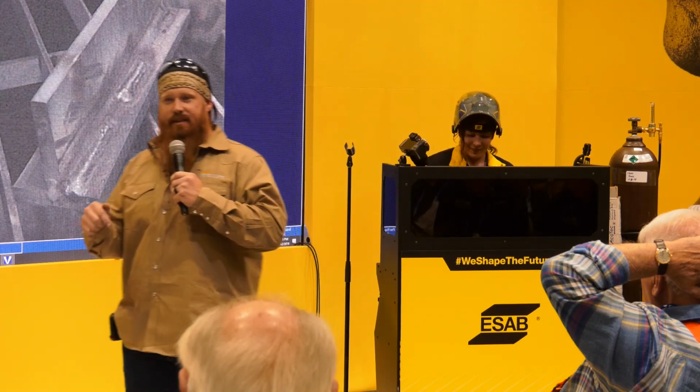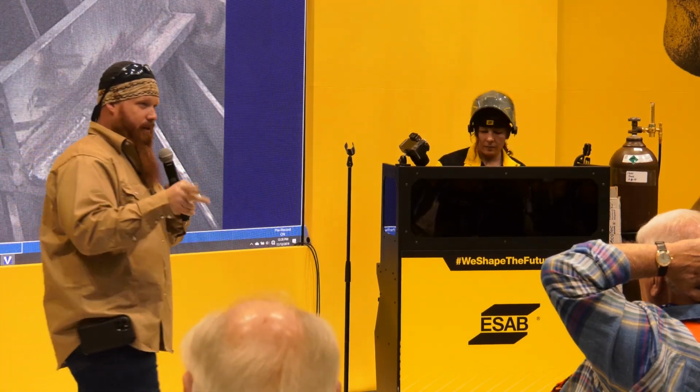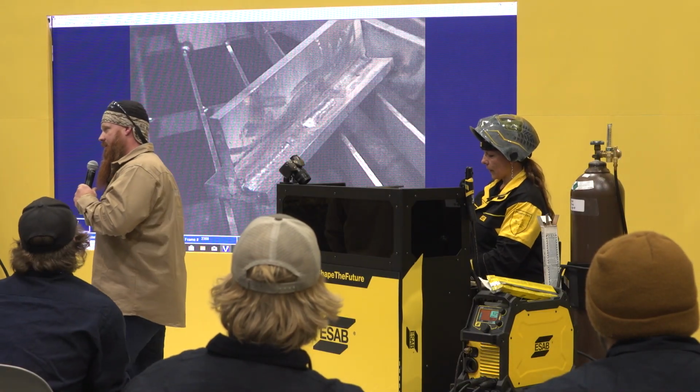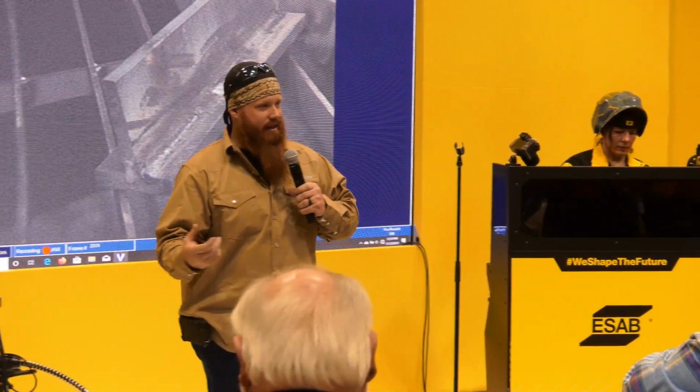It has potassium in the welding rod that's going to allow me to switch back and forth between those cycles, because if it does not have potassium in there, as soon as it goes to switch cycles, that rod's going to snuff out. You're not going to be able to use that. So make sure that the rod contains potassium, or it says it's rated for AC.